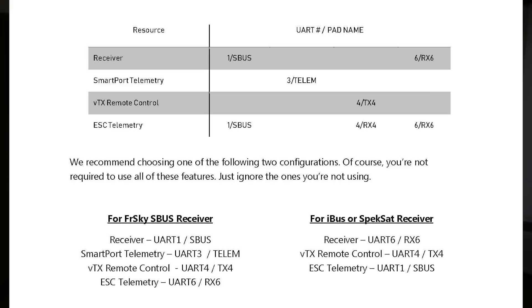The exact details on how to shuffle the UARTs around and make everything work are in the manual. Another question that has to be addressed: some of you may have noticed this board uses the CL Racing F4 hex file and may notice cosmetic similarities to the CL Racing F4. You may have heard that the CL Racing F4S has a problem where, with certain ESCs under certain conditions, the voltage regulator browns out and the quadcopter does a spin of death into the ground. The answer is no — this board does not have that problem. The power system, the layout of the ground plane, and the way the regulators are laid out are completely different from the F4S.